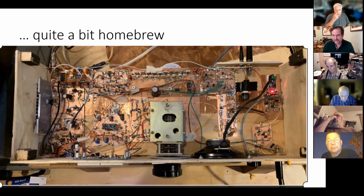Now, when I was building my first sideband rigs, I didn't have a whole lot of test gear. I was in the Azores and I had a friend in Sweden, SM4FQW. And I said to him, listen, I need to adjust my carrier oscillator frequency. I need you to listen from Sweden and tell me when I get it right. And he said, okay. I got my little screwdriver with the trimmer cap and I would call SM4FQW. How's this sound? Terrible. How's this sound? Better. How's this sound? Better. How's this sound? Worse. Go back. And we did that a few times.